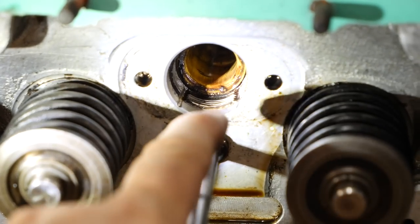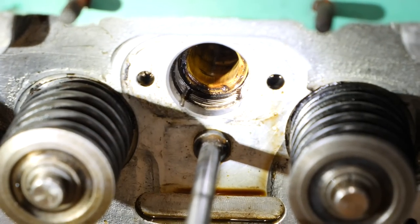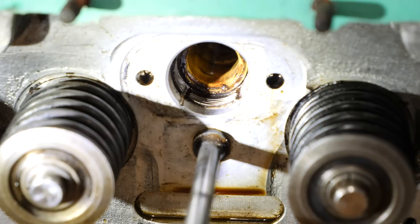And there you can see is the brass tube that gets swaged in there. And that's what we've been able to find so far, as it looks like it was an installation error and it was over-compressed, over-swaged, and caused a leak. So we're going to remove it and find out exactly where it is, but there's indications of a crack and deformation on the inside of the tube itself.